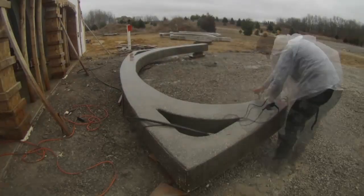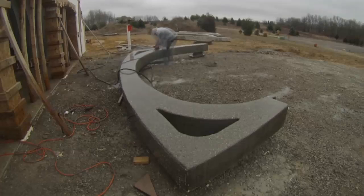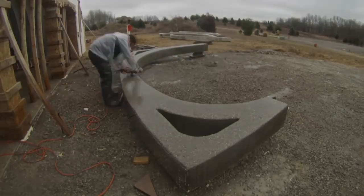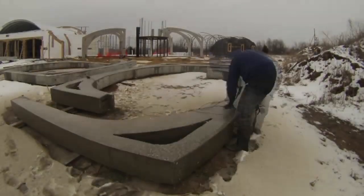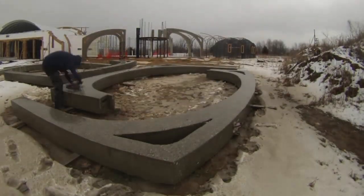With this set, I had bought a larger and more aggressive diamond cup wheel for that first step. It made that first pass go much more quickly, and I was really happy. So I quickly ran over all the ribs, but the scratches were deeper, and I discovered only later that the second pass took me four times longer to clean them up.